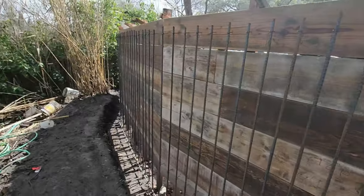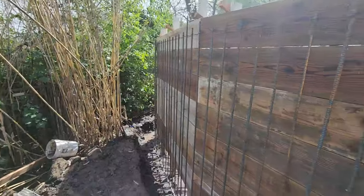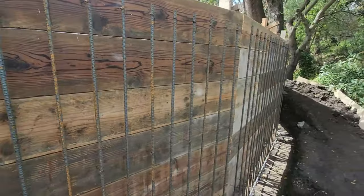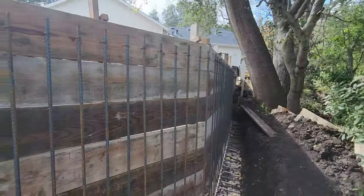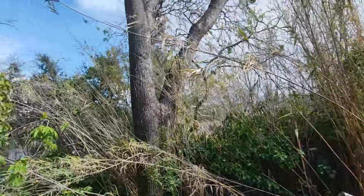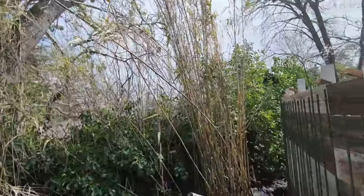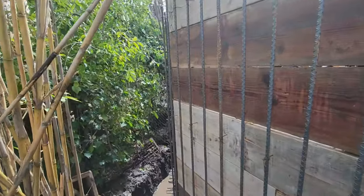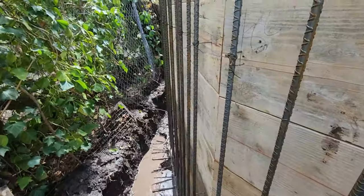All these are six inches on center. Ideally we go 12 inches on center, but this particular job — you've got to really read your plans. It calls for six inches on center verticals, and we're gonna go 12 inches on center number five as well for the horizontals. We couldn't get the drone up — would have been pretty perfect — but we've got a lot of trees and branches and the drone's sensors just keep it in one place when it sees the branches. You can see it's pretty muddy here.